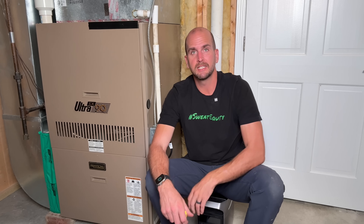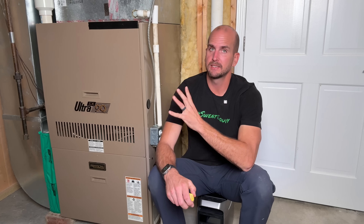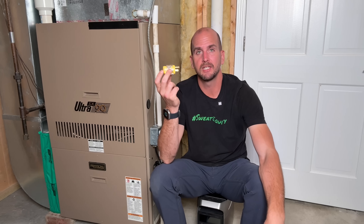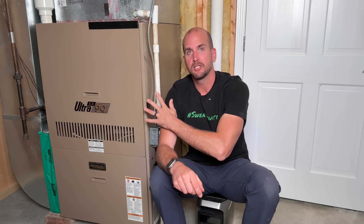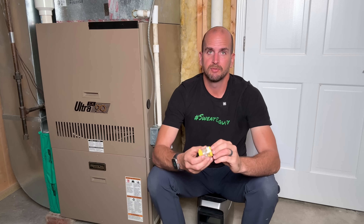The EcoFlow Delta 3 is a great-size portable power station, but at that power draw, this size unit would only last about 50–55 minutes without bringing in solar or one of their smart generators. This is a pretty large air handler and it does pull quite a bit of power. If you're using a portable power station or even a generator, you might need one of these — a neutral-to-ground plug that has the neutral and ground connected together. Because you don't have a dedicated ground from a generator or portable power station, depending on the age of your unit, that might cause issues. Everything you need will be linked in the description below the video.